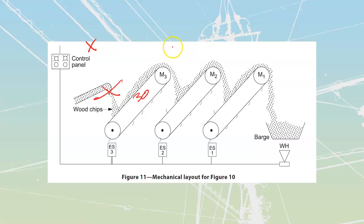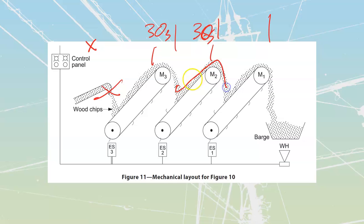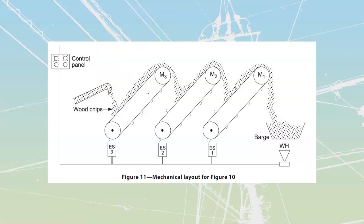I'm going to cut off the flow of wood chips at that point, but it's still going to take 30 seconds before this one cuts out, and then another 30 seconds past that, this one over here would cut out — so it's a total of 60 seconds between the stop being pressed and that, and then another 30 seconds past that, this one cuts out — about 90 seconds. Just to make sure that any load we have on here gets carried through and dumped before this shuts down, then that gets carried off and cleared before the next one shuts down, which means next time we start, we'll be starting with unloaded belts — super, super, super important.